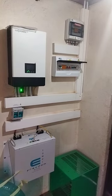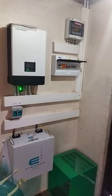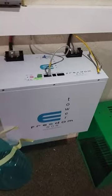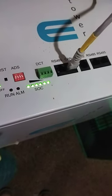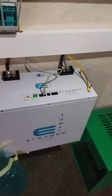We are here in Windsor West where we have just finished installing and commissioning a Lux Power SNA 5000 with a Freedom One battery — it is a 5.12 kilowatt-hour battery. The nameplate is quite hidden on the other side and it communicates using the Pylontech battery type setting on the Lux Power, with dip switch one pre-selected as on for CAN bus communication.